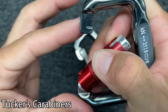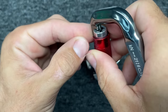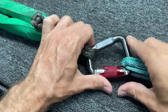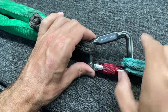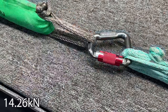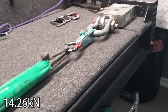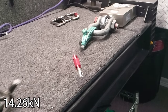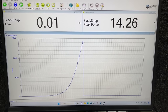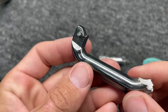That notch just isn't very big and that's why it seems to be coming off. This carabiner is never really going to sit in the center — it's going to pick one side or the other, and obviously one side is going to be stronger. I want to see what happens if your setup ends up on the weaker side. That's not the full strength. Interesting how that pin came off, but it broke there.